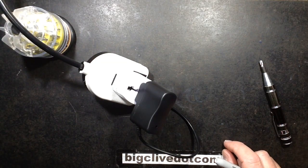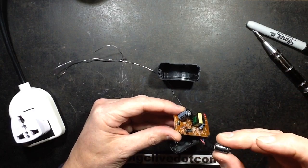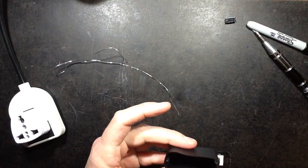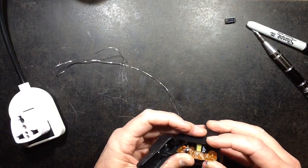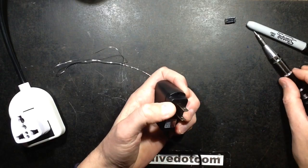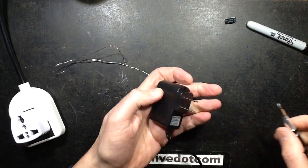That's not good enough - I'm going to have to modify this power supply to make it more exciting. Out with the old and in with the new. I've now replaced this seemingly indestructible capacitor that just squirts vapor out every so often, with a 470 microfarad 25 volt in the wrong polarity. So that should do it. Is this even going to fit in now? It's quite big. Oh, I should have thought of that. Is it going to fit? It's tight. It fits - took a bit of pressure but it fits. It might be quite loud. Exciting.